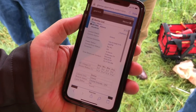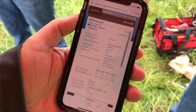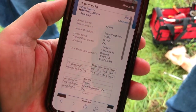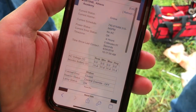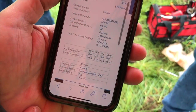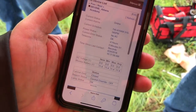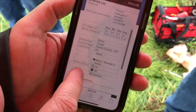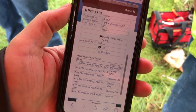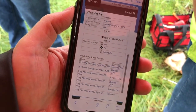We've now logged into the beacon that we just installed. You can see it's currently online — it's been zero minutes and 51 seconds since it connected. We can also see the lamp status is showing okay, which means we've wired in everything correctly. When we turned on the lamps, everything is working correctly. If you scroll down on the screen, you'll see where you can activate the beacon. We just turned the beacon on and it did come on — that's how we know the lamp status is okay.